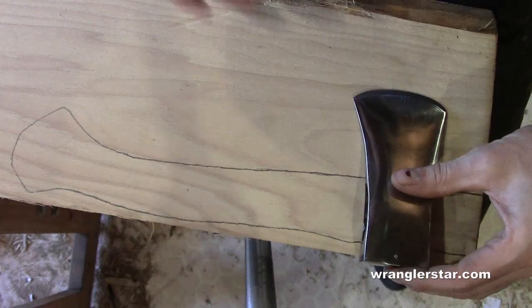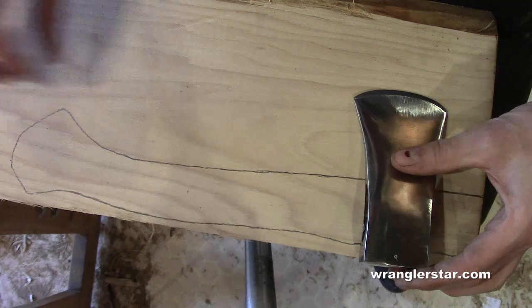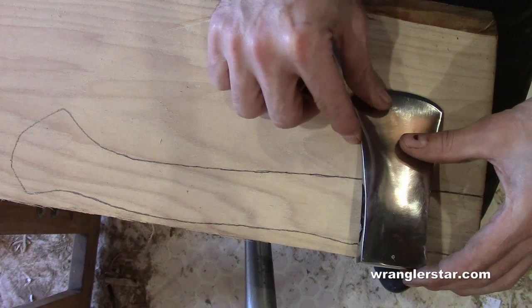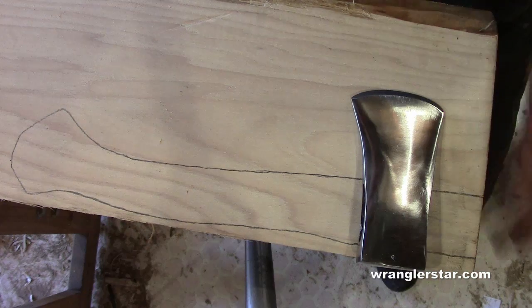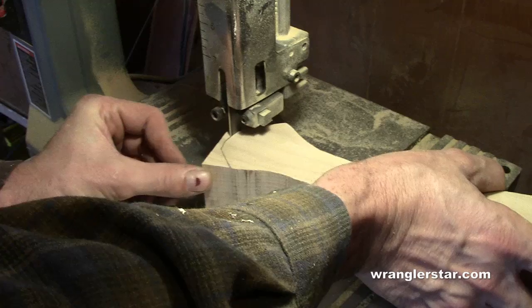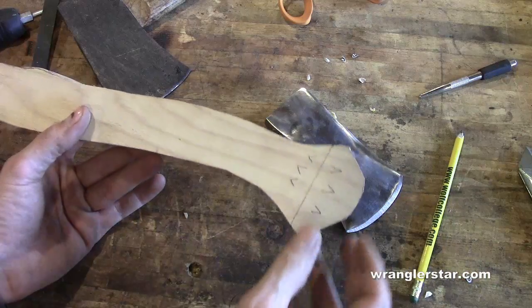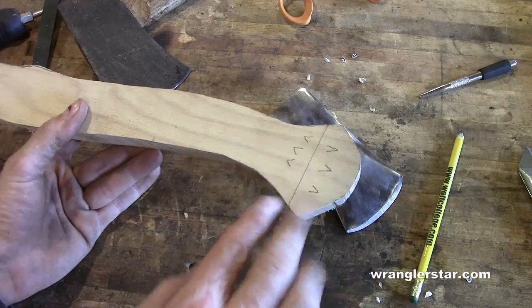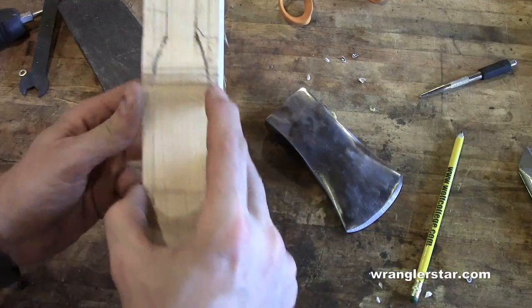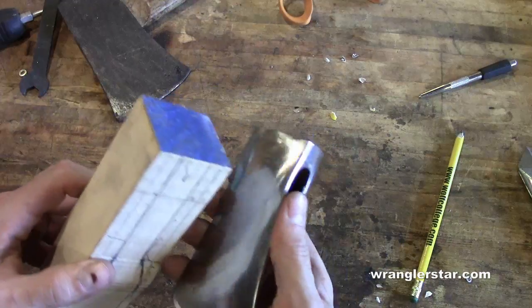This is the final design for Jack's hatchet that I've drawn out. I've given a lot of thought to this — I want it to be a hatchet that can be used really well with one hand. A big swell at the bottom, a nice organic curve, and in proportion to the head. You can see the side profile: this mark will be the transition where it starts to round into the knob at the end, then transitions in, skinnier for the handle, swells out where the head comes in, then skinnier at the top to fit the eye of the hatchet head.